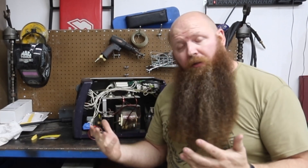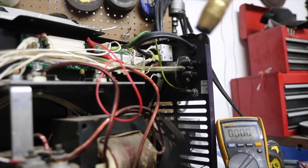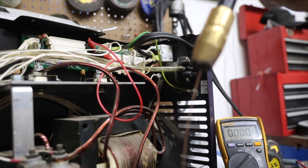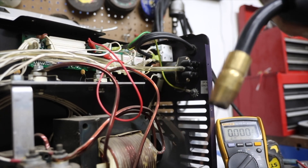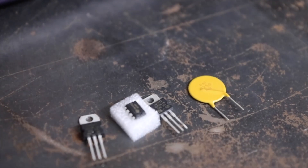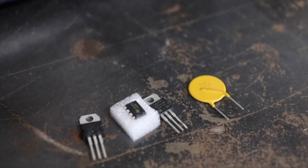I got on the internet, did a little googling, and messed with the circuit board. I got my test lead and jumped across the two PTC1 pins and it did make it run faster, but it was still kind of intermittent. So I dug a little deeper and apparently the speed controller on these is notorious for going bad. I ordered a kit that comes with the transistor, the speed controller, another resistor — all the common things that go bad in these. And now it's time to solder them in, which is the first time I've ever done that.